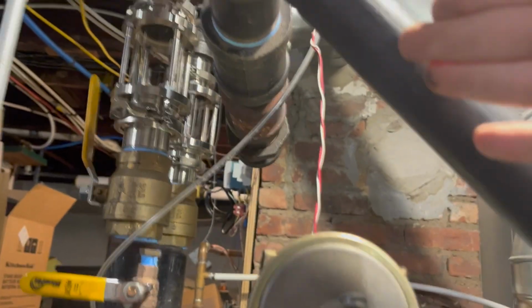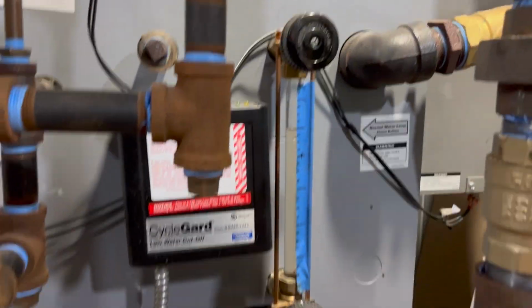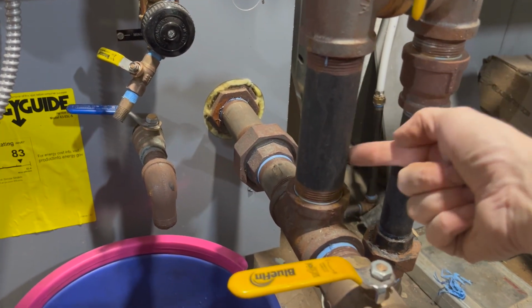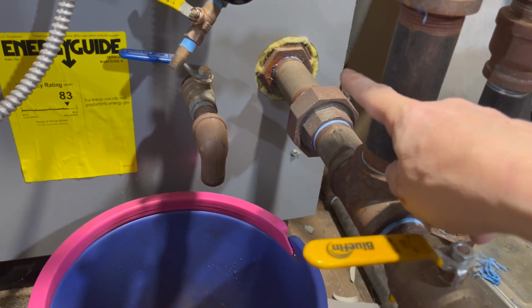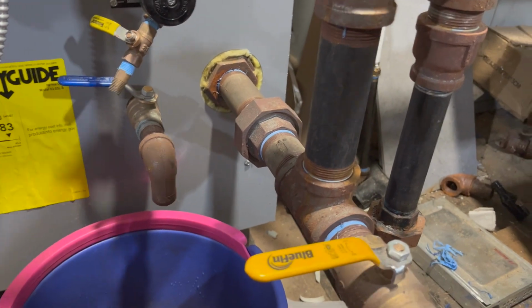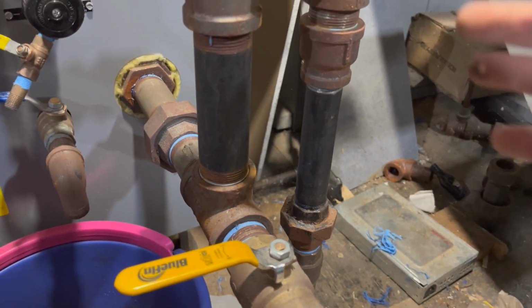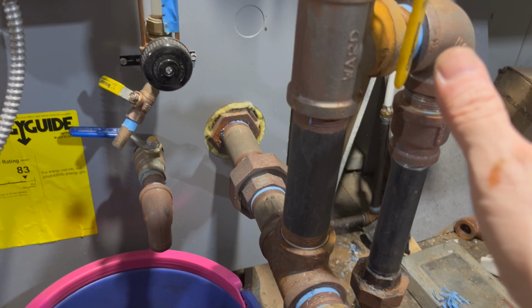The equalizer, of course, is here, so it's pushing 3 PSI down here as well. And that's where we've been told that somehow the pressure knows only to push this way toward the boiler. Somehow the pressure doesn't know to push this way down the Hartford loop into the wet return, thereby raising the water level in the wet return. That's the part that always confused me.